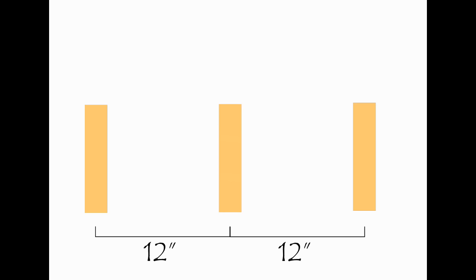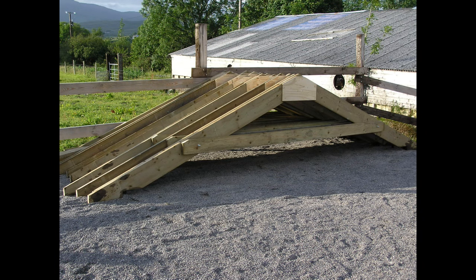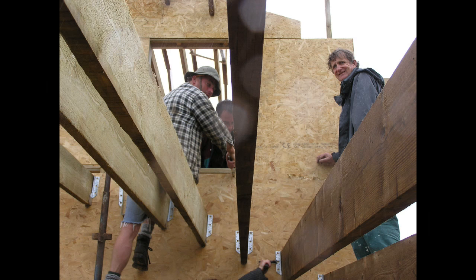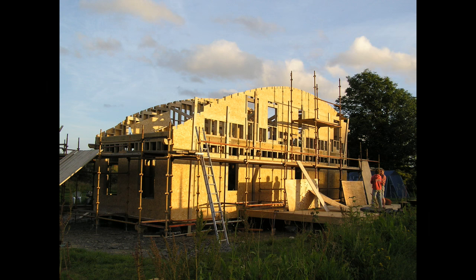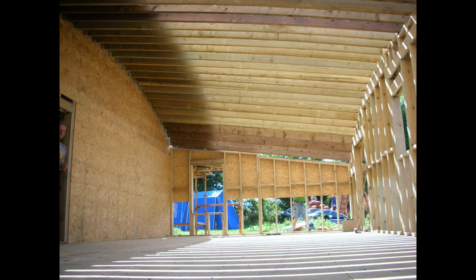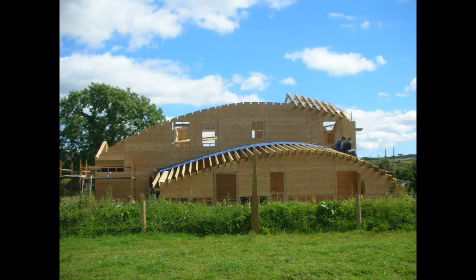The middle section is made up of A-frames or trusses, while the two lower roofs are just really simple straight lengths of timber. The curves themselves don't come from the rafters or from the A-frames — they are made from having the tops of the walls curvy. All the A-frames are identical, and all the rafters are identical. This makes the roof really quick, simple, and cheap to make.